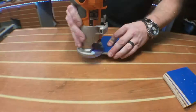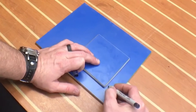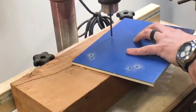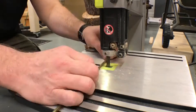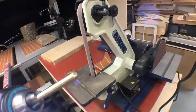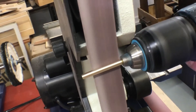I like how these are turning out. Now it's time to soften all the edges once and for all. A little hand sanding as well as the palm sander does the trick nicely. I take some of the remaining quarter inch stock and mark holes in each corner for the base — you'll see why in a second. I use my drill press for this, but you can use a hand drill as well. I then take this piece over to the crosscut sled, making sure I have a perfect square. I got some three-eighths of an inch brass stock here and I'm cutting it into two and a quarter inch pieces — I need eight pieces. I chuck these up in my drill and use my belt sander to clean them up, which really brightens up the brass quite a bit.